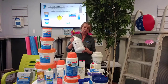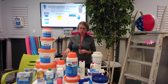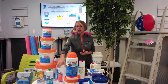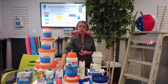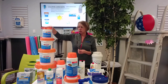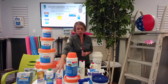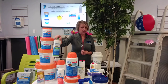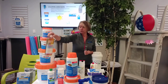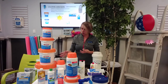So shocking the pool, adding your tablets — do it later in the day. Next to liquid chlorine, a three-inch tablet is probably the most popular. There is a three-inch tablet that just has a stabilizing product built into it. Stabilizer is cyanuric acid and it's like sunscreen for your chlorine — in moderation, it's great. It makes your chlorine hold on a little bit longer and doesn't burn off as quickly. We also sell at Penn's Pool an MPT tablet — multipurpose tablet — which is a chlorine tablet with a built-in stabilizer, a built-in algaecide (think homicide, suicide — algaecide is the killing component for algae), and a clarifier that coagulates those little particles making water cloudy, making them stick together so they catch in the sand better. All this built into one.